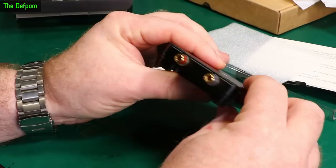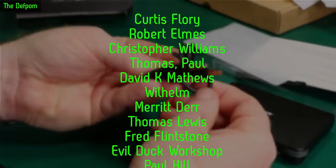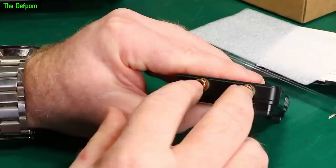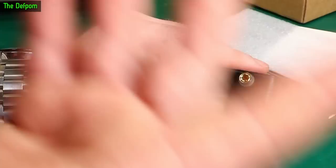Let's have a look in the box. It's got some banana-to-clip lead cables, and they're actually silicone cables — that's nice. One of my first observations is the spacing. Anyone who's been around test gear will know banana jacks tend to be 19mm spacing. These are not that, which is a shame — it would be nice if they were the correct standard spacing so you could plug in basically any cables lying around. But it shouldn't really matter that much, it's just me being a little fussy.